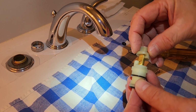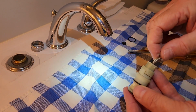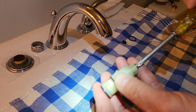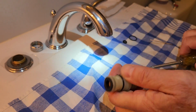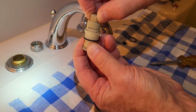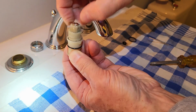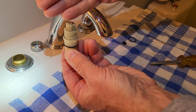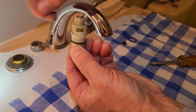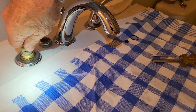Okay. Put your top back on, screw your screw in. Nothing has to be forced on there. Now this is a hot water valve, so you want to make sure you're putting it in there right. That's shut. That's open. Shut, open. So in the shut position, you want the arm out here. You can see where that Allen wrench was up against there, so you know that's going to point that way. Got to work it on down. There you go. It's in there.